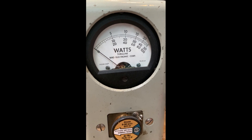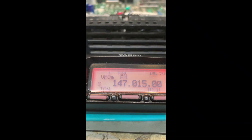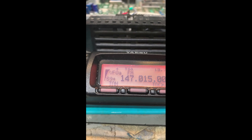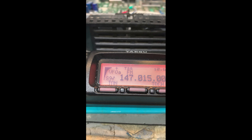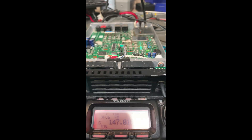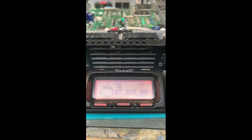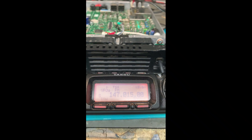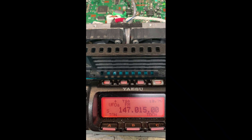Now for the real big one — did it impact the ability to trip a repeater tone? There's a local repeater; before when I first checked this radio nothing would happen. I'll be darned — learn something new every day. So ceramic filters do impact carrier subtones — that's amazing, totally amazing. Every time before this thing would not touch this repeater, and now it does after I replaced those filters. Crazy. Everything works easy. Now we know something new every day.